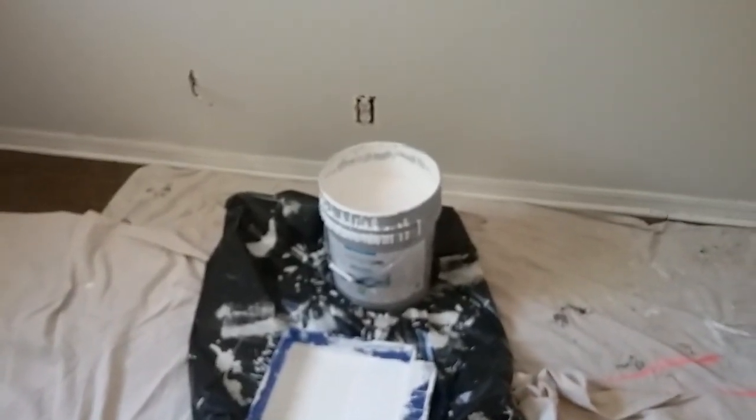I'm working without the light on because I've got natural light coming in this window - it will show you every dark space that hasn't been painted well. I first went this way, waited an hour after I got this paint on, and then I come back and go the other way. That ensures you get every side of every one of those little pieces of popcorn hanging down there. That's another reason you want a really thick nap - half inch or three-quarter inch. I prefer three-quarter inch. Same with rough textured walls - it holds a lot of paint and gets the job done.